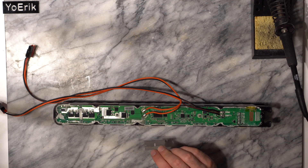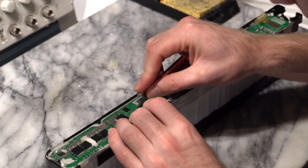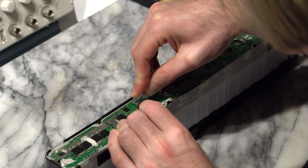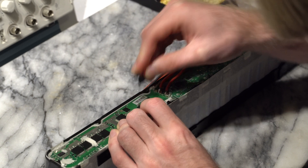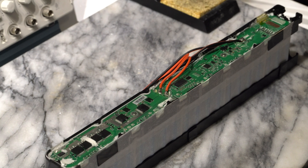We can cut through the glue with a razor blade to get access to pin 3. You have to be very careful so you don't put too much pressure on the razor blade and cut through the PCB traces, as this can easily break the battery pack. Usually you can scrape away any extra with your fingers, so don't be too worried about cutting everything away.